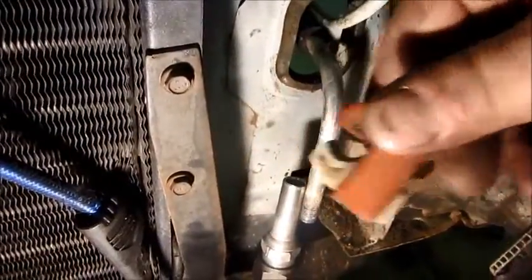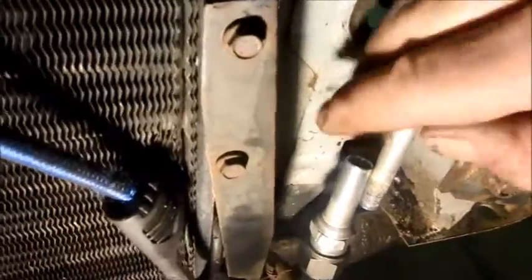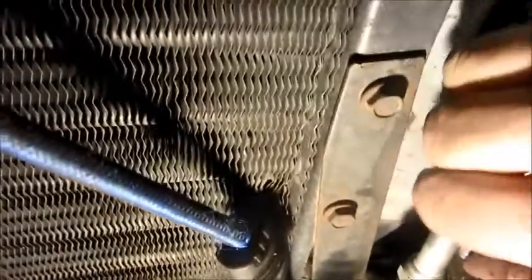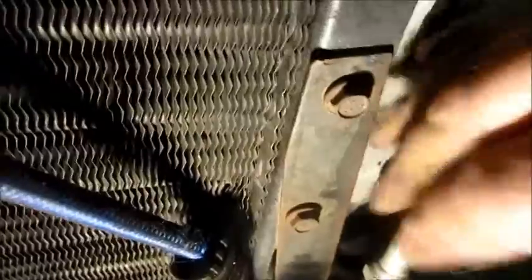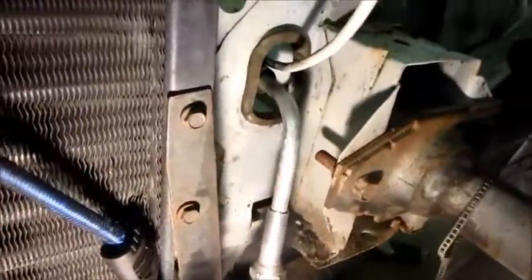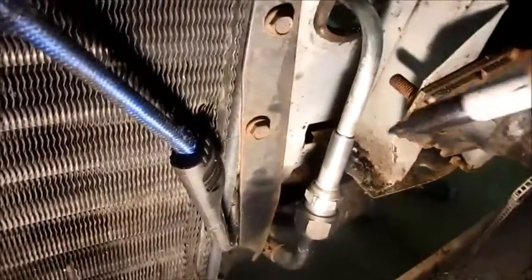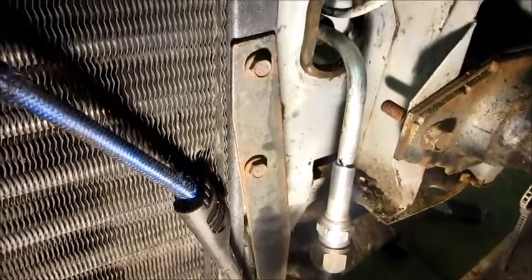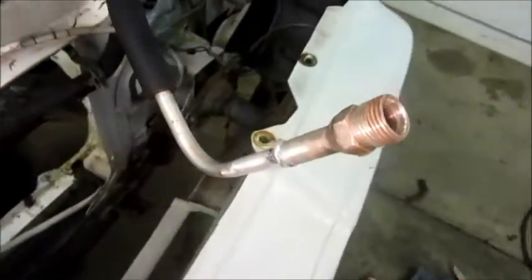I just had room to get the little mini tubing cutter in there and cut that end off of this line. Now I'll see if I can get it to slide inside the other one — like so. That's basically how it's going to have to be to work. Get the sharpie marker out and make a mark on it right there. Then take it all out, clean it up, and braze it. There is the new brazed-together line. Needs a little bit of cleaning, flushing, and then we'll see how it fits.